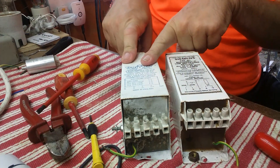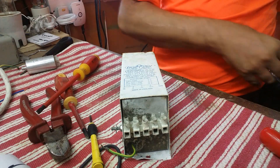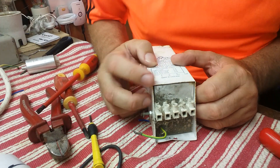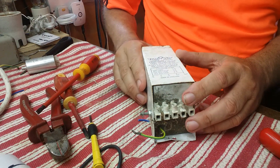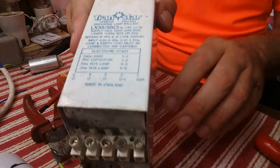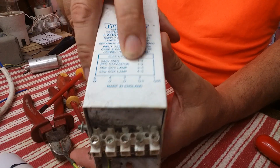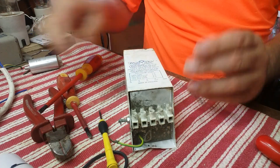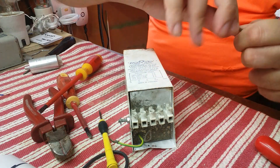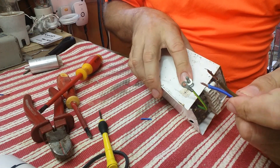What we're going to do is see if we can fire this one up and I'll show you how to wire this one as well. If you're following along, you do so at your own risk. We'll move the Siemens ballast to the side. Starting with the power in — the power in on this one is at the top there. So power in 240V, pins one to two, so it would be these two here. We connect the power to this, and it's also got an earthing point on the side.